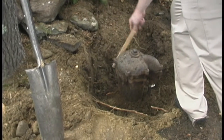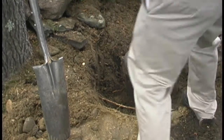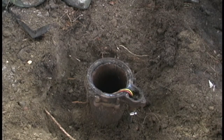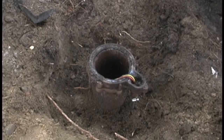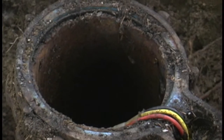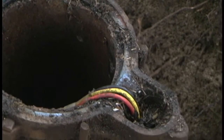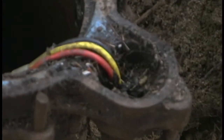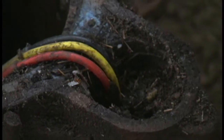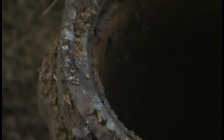Insects and everything have gotten inside. So the first thing we do is clean off the outer well casing so different components are recognizable, and let's do a little more inspection. We can clearly see the contamination has entered through this poorly sealed or unsealed well cap. You can see insects in there, cocoons, spiders, everything you can imagine — they've gotten into the well system.